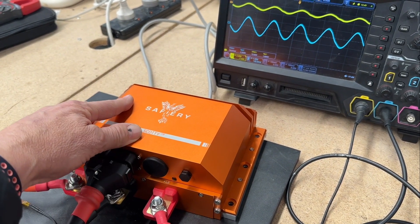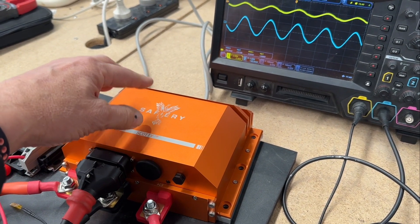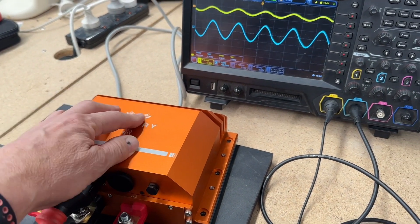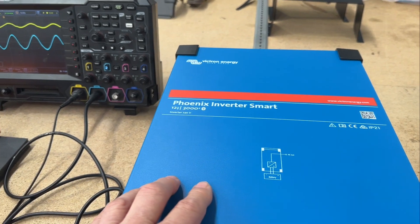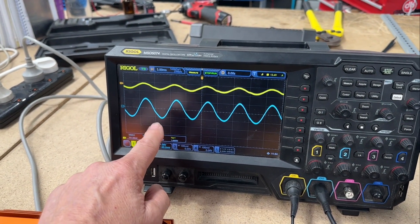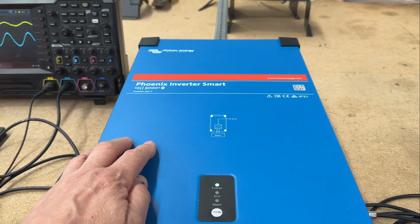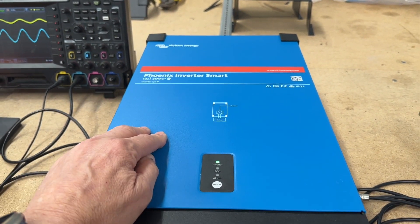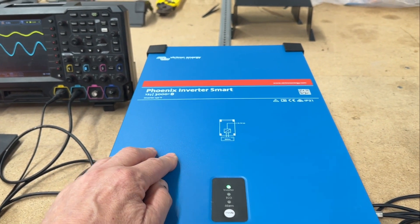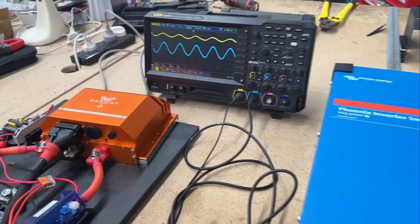The fact that this holds up quite comfortably — I've had it running at 3000 watts in a boat and it runs very comfortably — means that Scotty can keep pace with the demand of the inverter. The elevated ripple we're seeing on the DC side does not affect the Victron inverter. That's quite an achievement, and full accolades to Victron for that. How good's that!